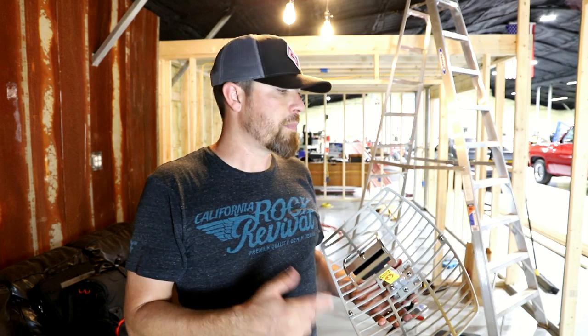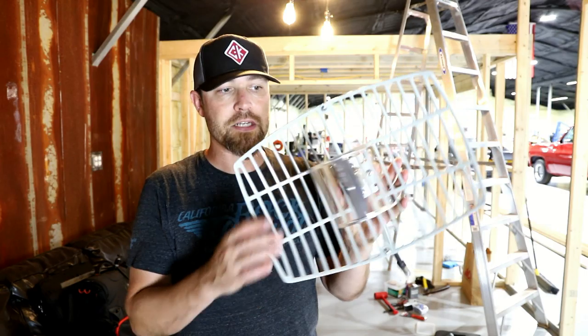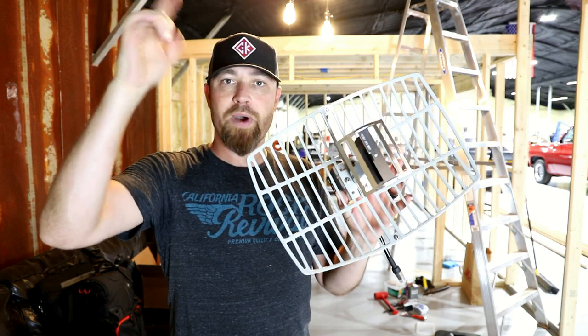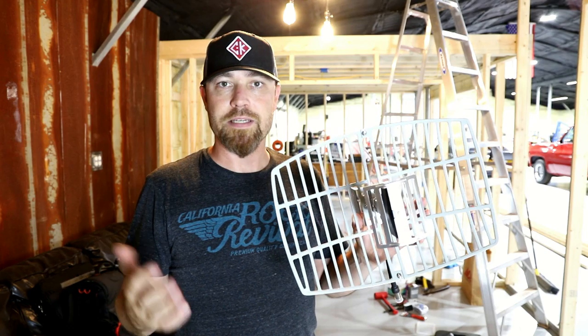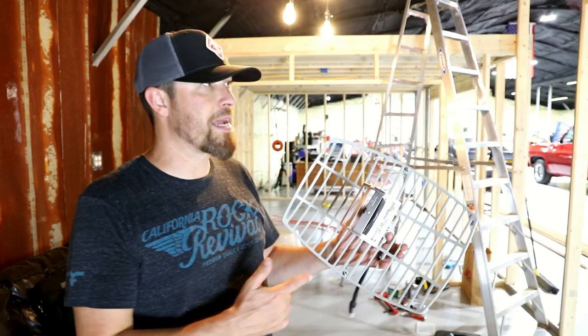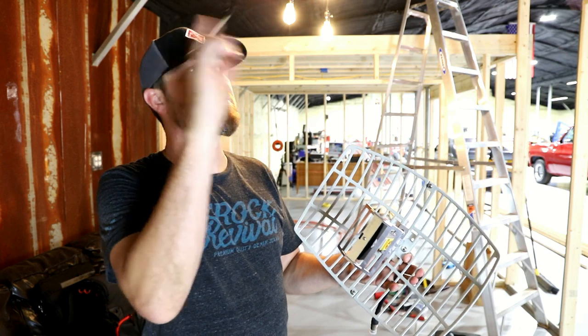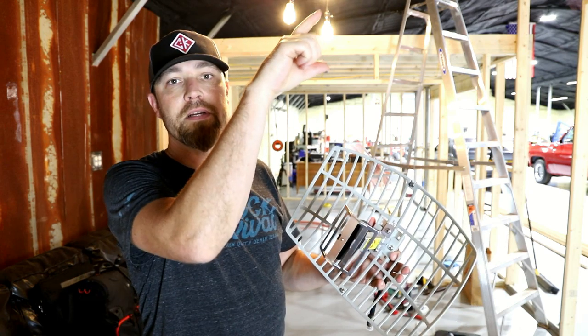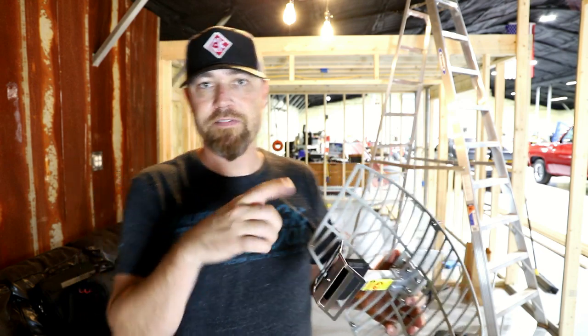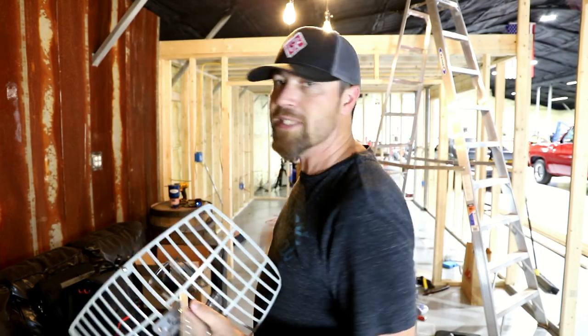It's hard for me to post stuff on social while I'm in here. So what I'm going to do is install this repeater. I've got a buddy of mine that uses one of these and it basically steals his Wi-Fi signal off his house and repeats it within his shop — it works awesome. He streams football games and all kinds of stuff on it. I'm going to make some brackets, install this thing outside, run some cabling in here, and put the Wi-Fi antenna up in the eve of the shop. The other nice thing is it'll do Cat5, so you can plug two Cat5 cables into it. I'll probably run those down and tie them into the office so if I have a laptop in here, you can plug right in and get a direct connection versus a secondary Wi-Fi signal.